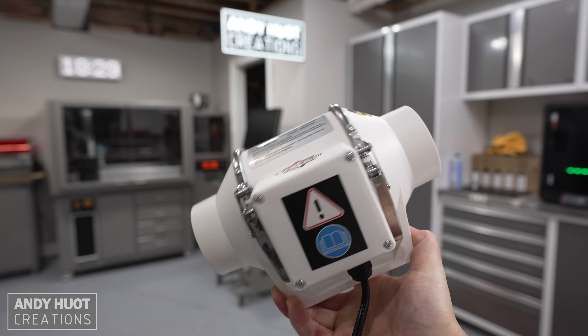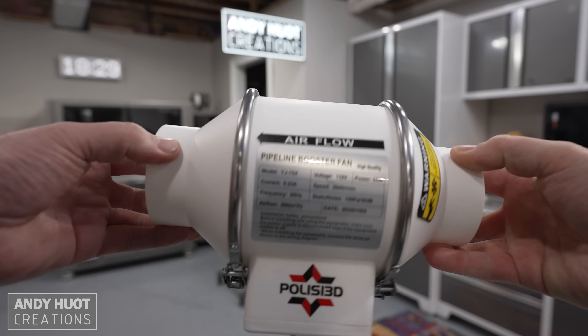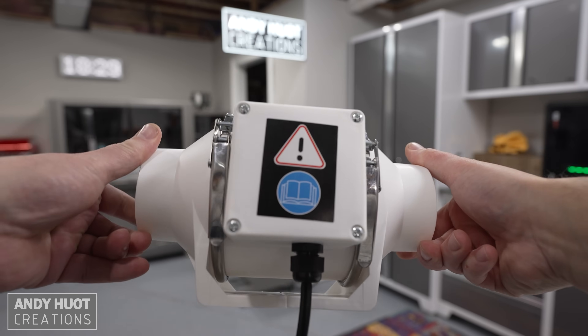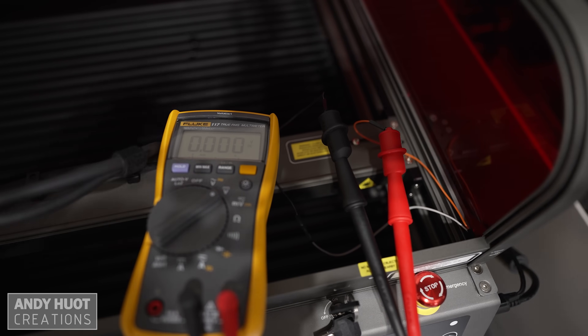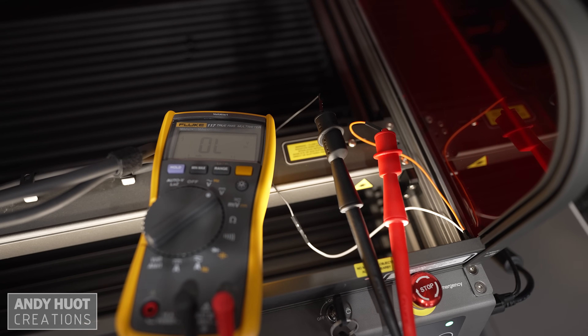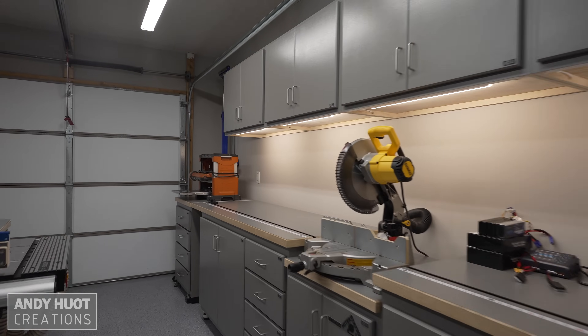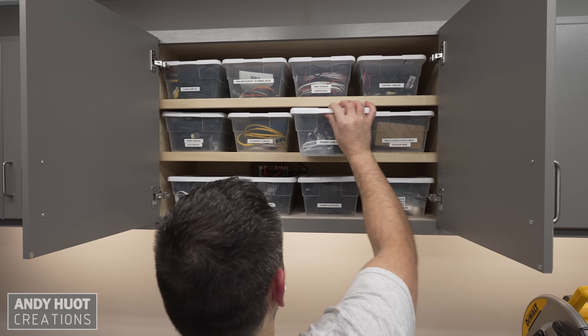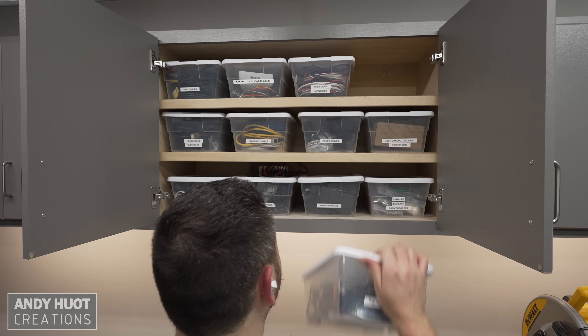I wanted extra exhaust power, so I bought a 3-inch inline 120V AC blower to put after the enclosure fan. I'm hoping to use the unused fan connector on the right side as a signal to turn on my external inline fan. I need to verify that there is voltage across these pins when the fan is turned on and no voltage when it's turned off. Everything looks good, and now I have a 24V signal for the fan. I'm going to use a solid-state relay with a 3 to 32V DC input to power the external fan, which will automatically turn it on or off when the laser controls it or when it's switched by the switch on the frame.